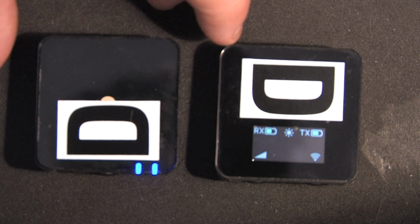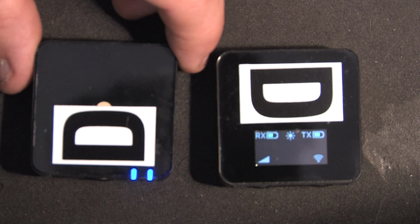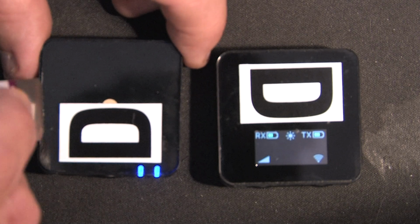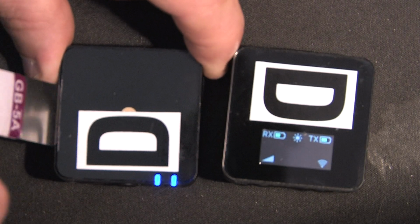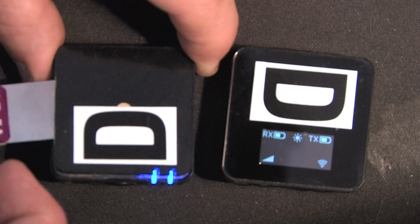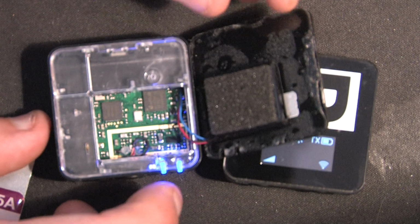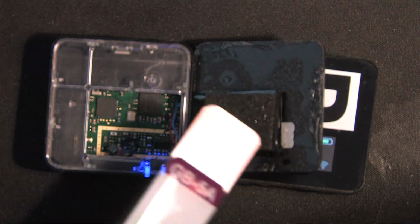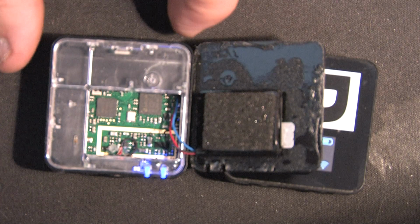And I know this because I've worked out how to open this, and I've worked out how to fix it. So my fix, or how I opened it and fixed it, or at least have determined what the cause of the problem is: stick a pry bar or a spudger in this gap here and apply pressure, twist and then gently move around, because you are fighting a glue, so there is like a gluey compound there. Interestingly, it gives us access to the battery, so it does mean that going forward the batteries are actually probably changeable in these.